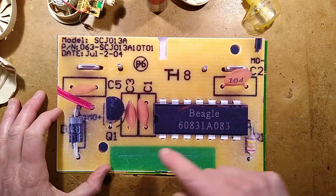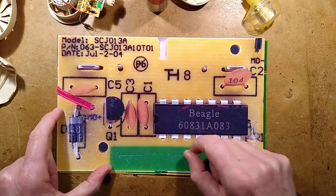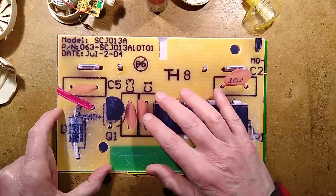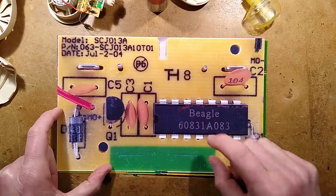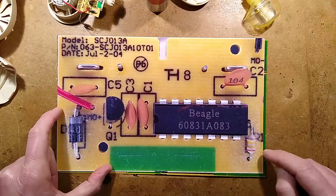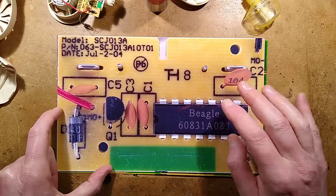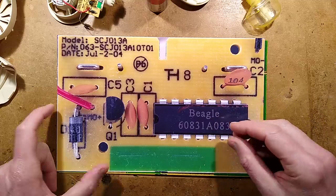There's a diode across the motor, a transistor for switching the motor, a decoupling capacitor, and then three other capacitors in the circuit — one possibly for reset. And then there's a very high value 240k resistor which looks as though it's setting timing, which I think is based on binary given the sort of on-to-off cycle.